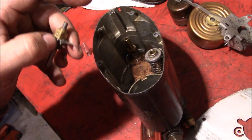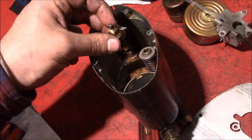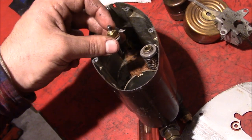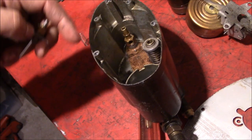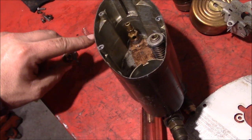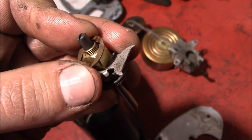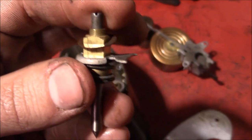The easiest way to do this is with oil flowing into it — start low and keep adjusting the level higher. If you fill it up too high the first time, you'll have to drain the whole reservoir and start over again to get your right oil level set. And don't lose this copper square washer that's on top here — this helps set the level of everything too.